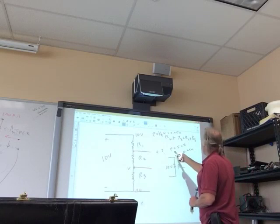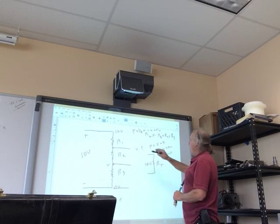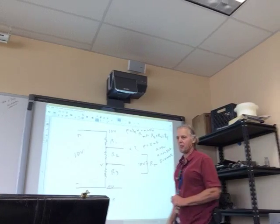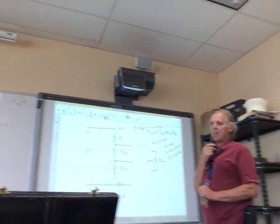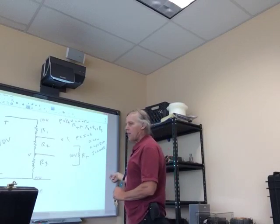So I know that P is 0.25, and that equals I times 10. So I equals 0.025 amps, right? So now I know the current through all three of these resistors. I also know the wattage. So now I know the voltage on all of those resistors and the resistance, don't I? How do I do it?